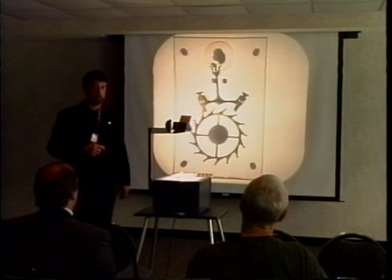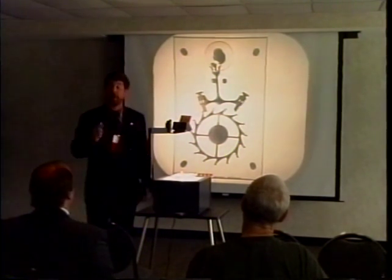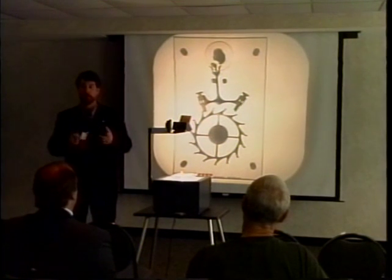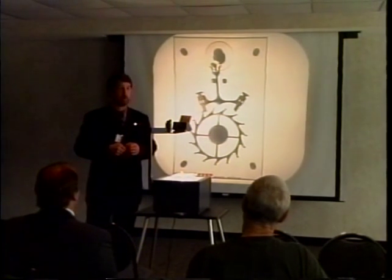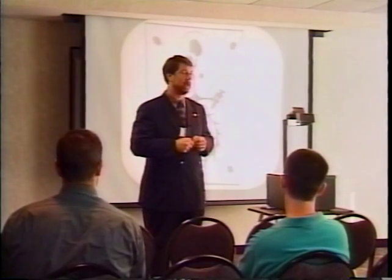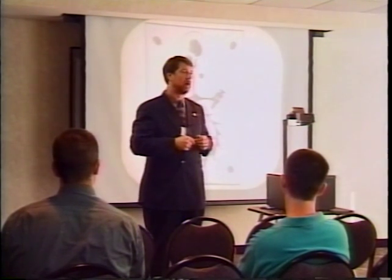Okay, so let me see if I can repeat the question. So the answer to my original question is that it only affects the corner clearance and drop lock, opposite, slide the same, correct? If you push the stone in, that means that the slide is going to increase. Total lock's the same. If you push the stone in, corner clearance and drop lock decrease.